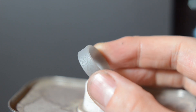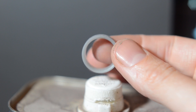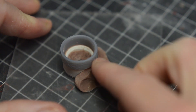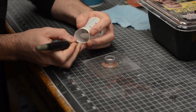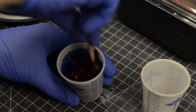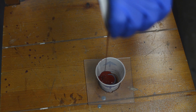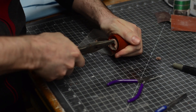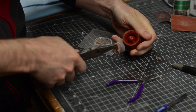So I set about making a mold of this piece. Something I didn't do to this part at all was sand it — at the highest setting off of the Form 2, it did not need any sanding. I could have buffed it up a tiny bit, but I wanted to see how it would look without any further sanding. So I took that model, clayed up a little bit of a pouring spout on it, then mixed up my silicone. For this one I used Mold Max 60, a high temperature silicone you can pour molten metal into. I poured this onto my little model, let the silicone cure, and I had myself a fancy little mold. It came out all right — I should have degassed the silicone, there were some tiny bubbles that affected the surface quality — but overall I was pretty happy with it.